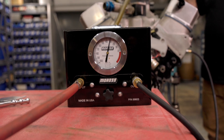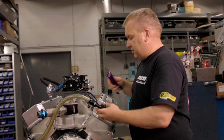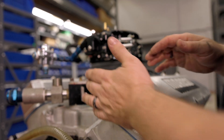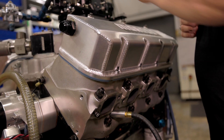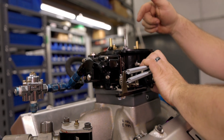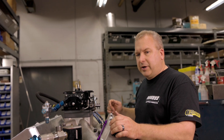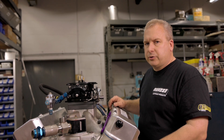Now let me show you a couple quick tips. Right now the exhaust is open, carburetor's here, and we've got a vacuum pump. I'm going to take this hose off — I put my hand over this and I can feel some air going by it. This is telling me what's coming out here is what's going past the rings because it's filling the crankcase and coming up and out of this fitting. I can also put my hand over the exhaust port and feel a little bit coming out here. Now if I open the carburetor up, I don't really hear or feel anything coming out — so it tells me the intake valve is sealed up nice. That's the three points we're looking for: if we have 30% leak down, can we diagnose where it's coming from? In this case, the amount of air coming out here tells me the rings probably need to get replaced and get a new hone job. That exhaust valve just needs a quick touch-up on the seats, and I'm pretty sure it'll seal up pretty nicely.